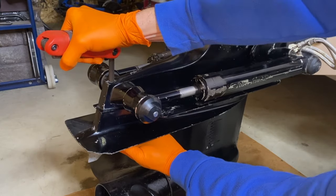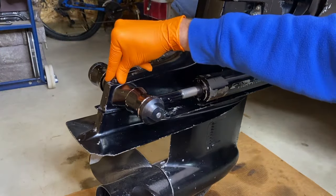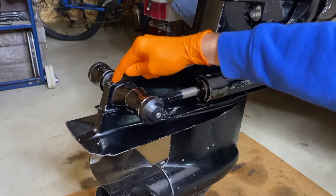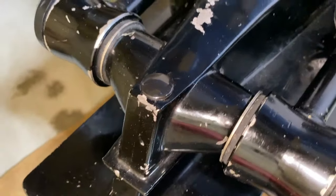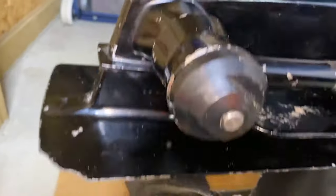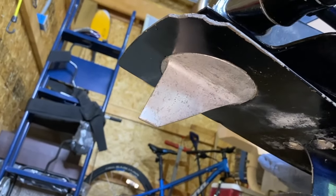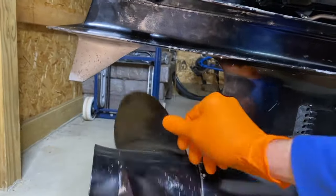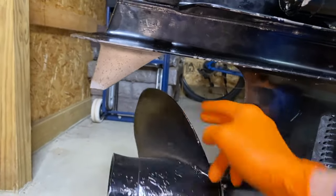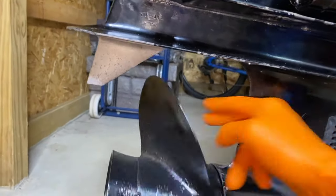You want it snug, but do not over-tighten it. If all looks good, go ahead and reinsert and secure your plastic cap or plug — here's a close-up view of that plug. Coming down below to our brand new installed anode. Verify that the propeller clears it, both reverse and forward. There is a large gap in between, so that propeller is not going to strike the anode and destroy it.